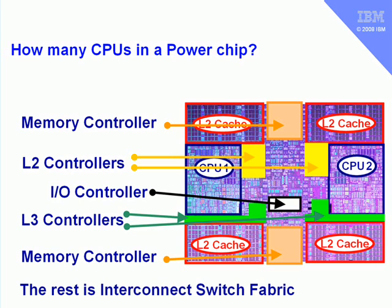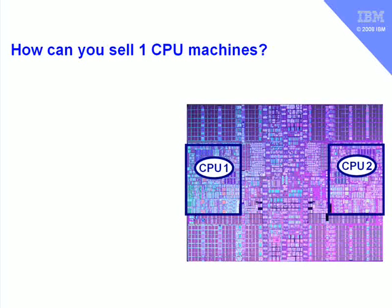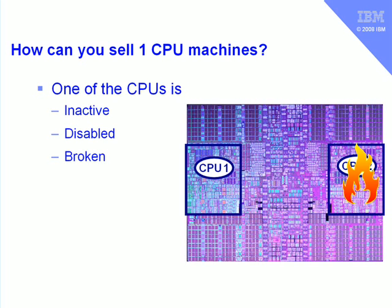This gives us the way we can communicate directly from this chip to the next chip in the machine. All the hard work is done in the processor itself, so we can just join copper tracks from this chip to the next chip and they can instantly communicate with each other over this switch fabric. It also has the interconnect to go to further chips further away, so we can join the whole machine together and make a single SMP image.